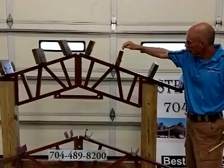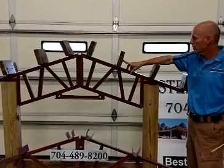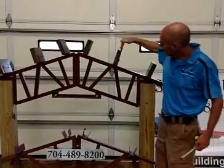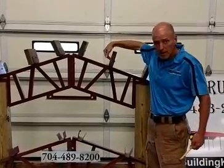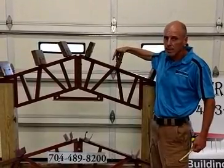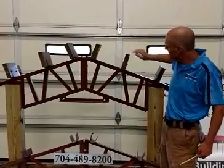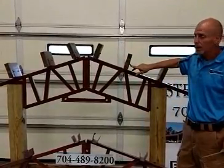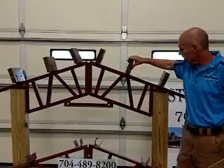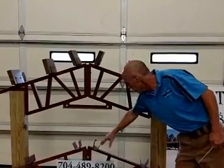But you put the trusses and they go into this purlin cup. The purlin cup has pre-drilled holes in it that you screw into. Now, what we recommend is putting the purlin in the cup, screwing the top side, the upper side in first. You want to make sure that's nice and straight, because sometimes they get bent in transit or just from handling. So that's nice and straight, screw that in, then bring this one into it.